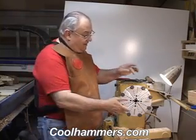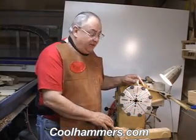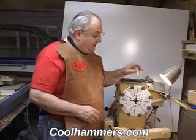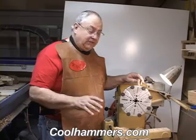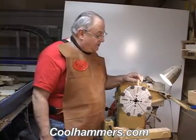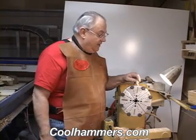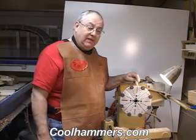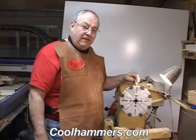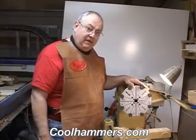So what we're talking about is the diameter of your workpiece, in this case, 10 inches. The fastest speeds that we can safely turn this would be the diameter of the workpiece, 10 inches, times the RPMs. So 10 inches times, let's say, 600 RPMs would give me 10 times 6, which is 6,000. So that would be about the slowest I should turn it. For my tools to cut effectively, I should run a 10-inch piece at about 600 RPMs.